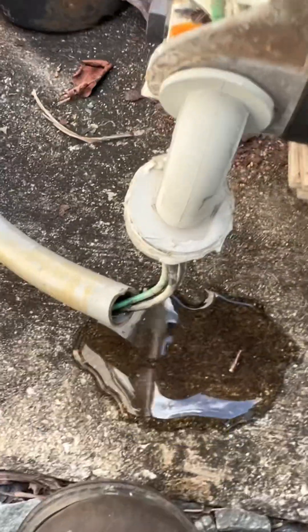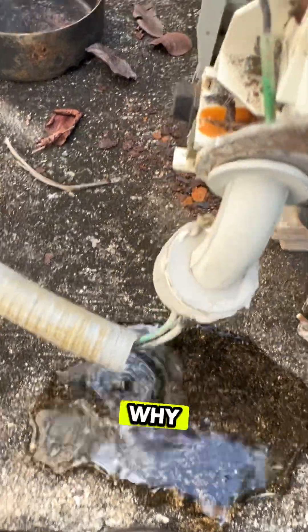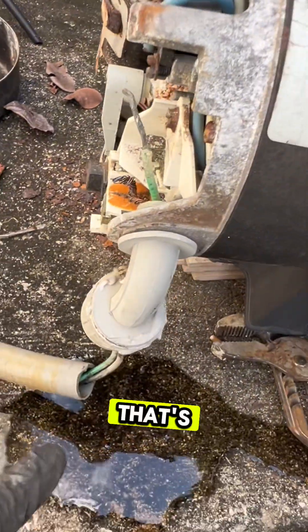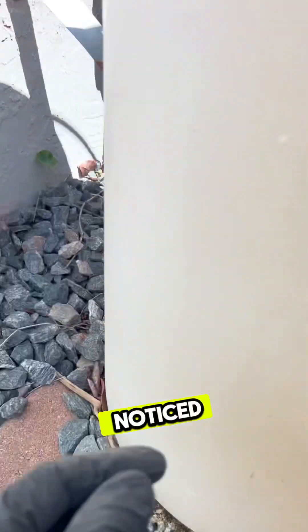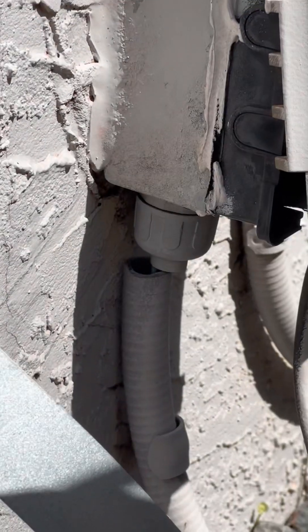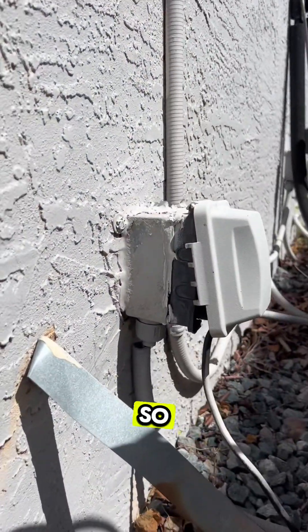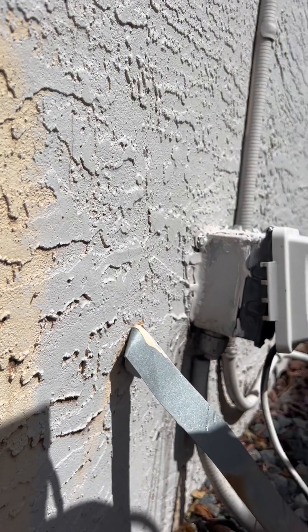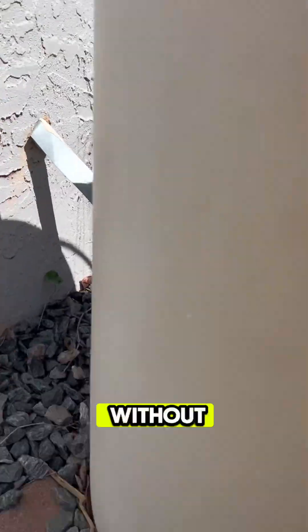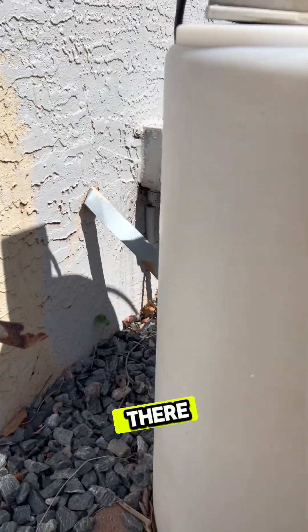Because this wasn't connected when I got here, there's actually water inside of the conduit. So now we don't have to wonder why things got so corroded so quickly — that's how. Before I make the final connection, I noticed how the water got in. What I'm going to try to do is blow backwards on this side of the conduit and see if water comes out over there. Water came out — now it's clear. Without the water in there, we'll go ahead and make our final connections, get wired up and get that reconnected in the opposite order.